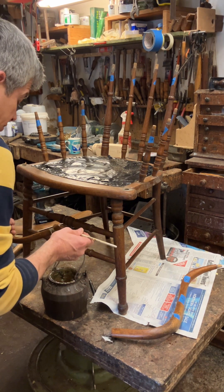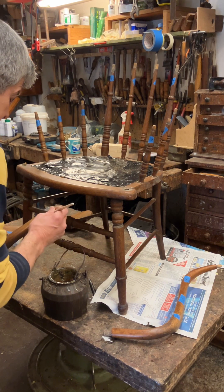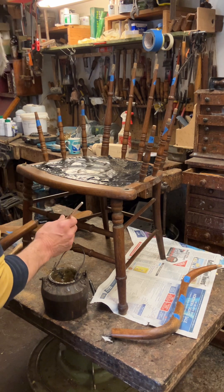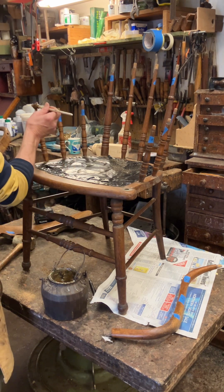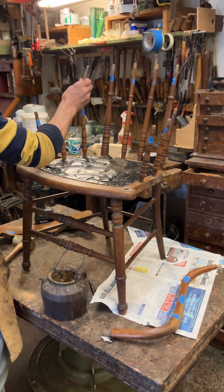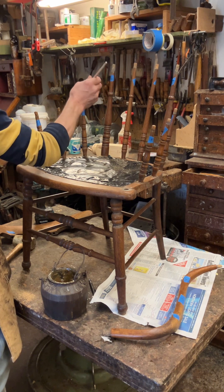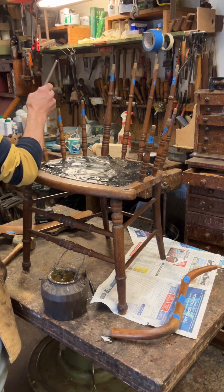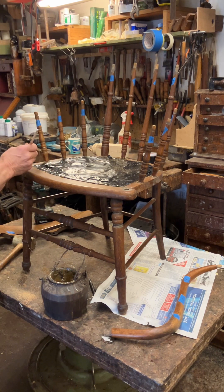This front leg isn't great but hopefully it'll be alright. The dowel is quite broken so I might have to later on drill from the bottom, but we'll see how we go. So I'm going to put quite a lot of glue on these. The good thing with the animal glue is it sort of sits there - it doesn't just run off - which makes it much easier when you're putting on multiple things. I'll put a bit of glue in, actually into the broken wedge.